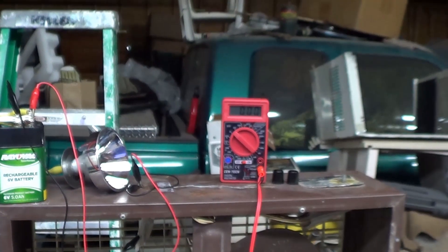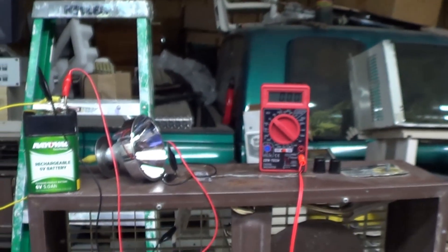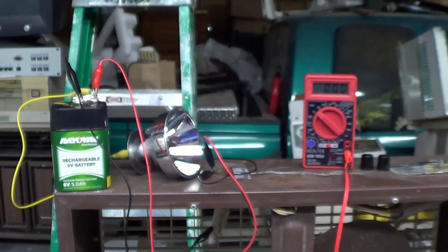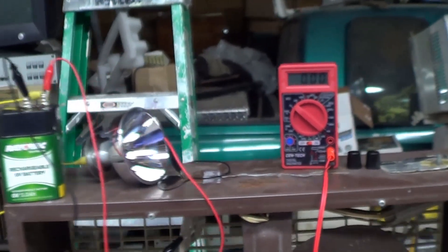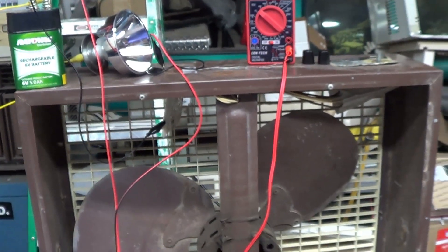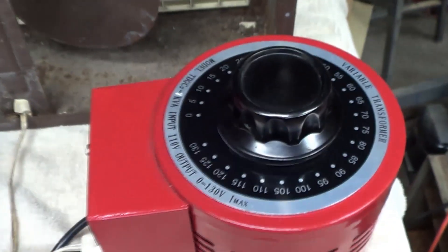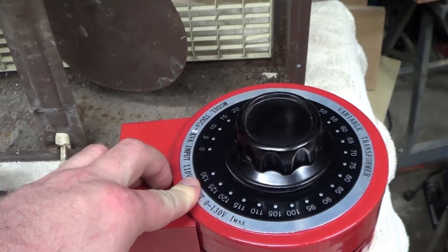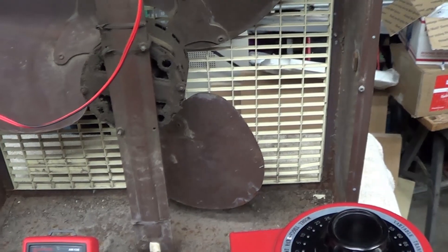Another stipulation of the contest is that your approach should have a certain measure of longevity — if it only lasts 30 seconds or similar, it's no good, so they'd like to see a five-minute demonstration. I have no idea if this thing will actually survive for five minutes, because this is a real Rube Goldberg of a thing. And if you're thinking that the moment I turn this fan on it's going to go too fast, preventing me from meeting another stipulation governing the flash rate between half a cycle per second to two cycles per second, well, you'd ordinarily be right. But I am controlling the fan speed through this handy variable autotransformer, which allows me to adjust the line voltage from zero up to about 130 volts AC or so, and I'm hoping I'll be able to find a sweet spot to control the fan's motor speed precisely enough to meet the requirements.